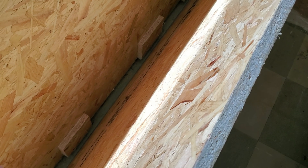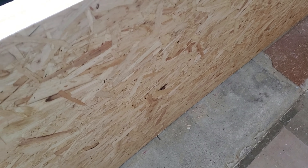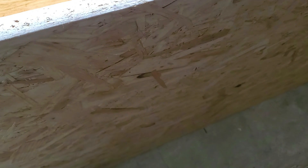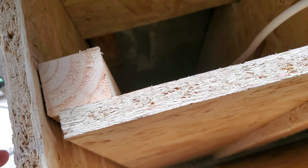I've been tweaking this design this morning — this is the final outcome now. I'll put blocks on the bottom to sandwich this board. Heat rises, so there shouldn't be much transfer of heat through there, because the radiator is about six inches off the ground. When the radiator is on I'm going to get those wee round air vents that you get for fascia boards and put them below — that'll allow air to suck in between the end boards as well as the radiators. I've got it all squared up — it was slightly out, so I had to make it a wee bit longer.